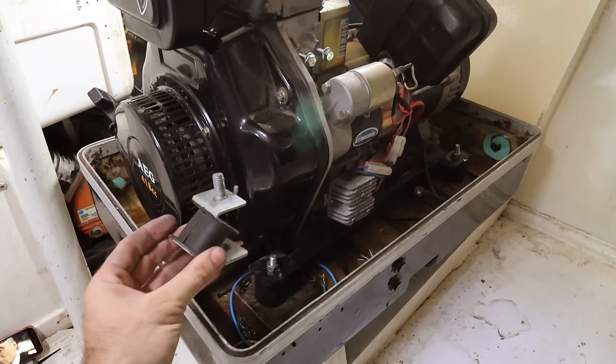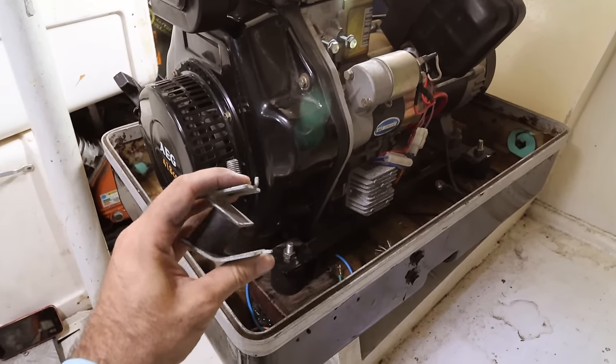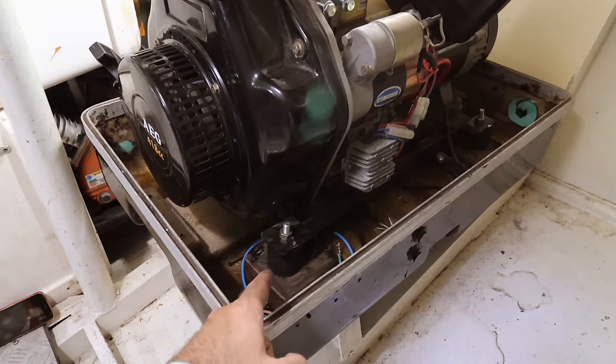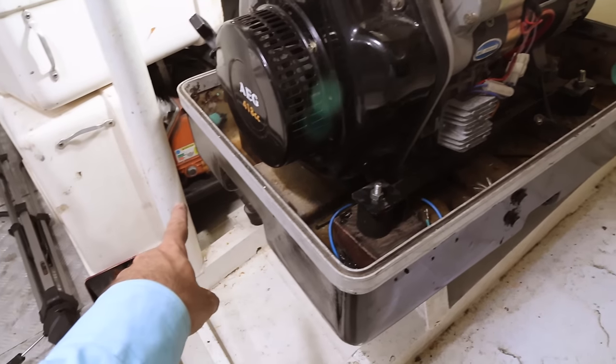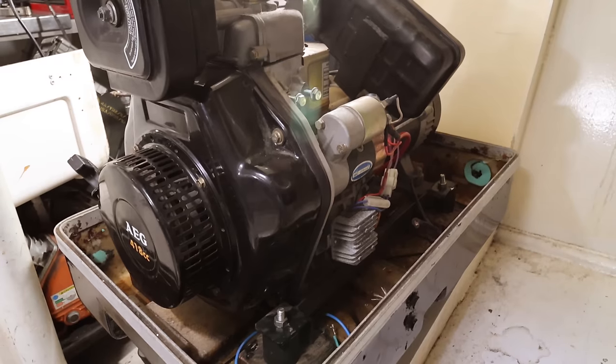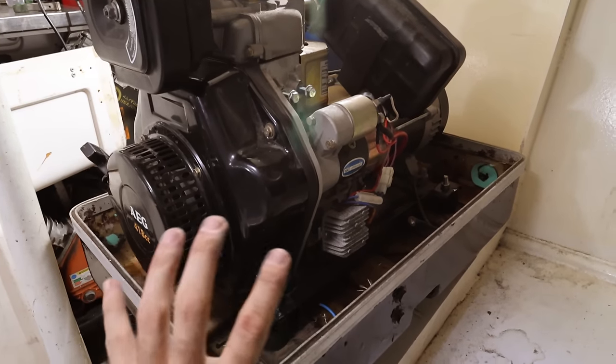I've just swapped out the engine mounts. These are the original engine mounts, and you can sort of see they're quite soft. There's a lot of flex in them. They were great, but we've found in the boat stiffer mounts actually work better. We found that on the compressor over the back here. When we had soft mounts on there, thinking that would isolate sound and make them nice and simple, it actually got quite a lot of oscillation going on whenever the boat moved and things like that.